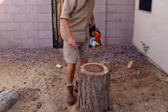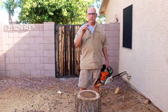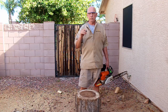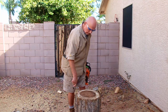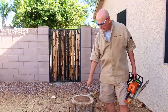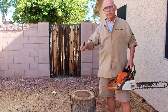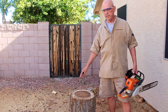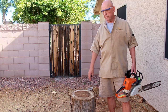I've marked the pith, and this is really important because you've got a pith on either side. Depending upon how you rip this log, you're going to have the pith line either just above the cut where you won't see it, or below it. Where you have that pith, the wood is going to crack there. Ideally we'll cut right down the middle, and when we mount the piece on the lathe and start to rough turn the outside, you'll see where the pith catches the rim and cracks a little bit. You've got to turn all of that off — if you don't, it'll continue to crack during drying and you could lose your bowl.